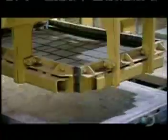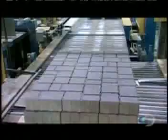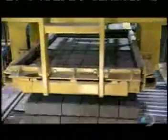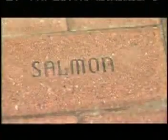Now, hydraulic clamp arms lift the pavers off the board and begin to pile them up. They're making a cube of stone. This stacking machine is called a cuber. It packs 9 or 10 layers of pavers on top of one another to make this cube. The cube is actually called a bundle. It will be strapped and shipped out to the job site. These concrete pavers will be on the road soon, building and rebuilding our streets.